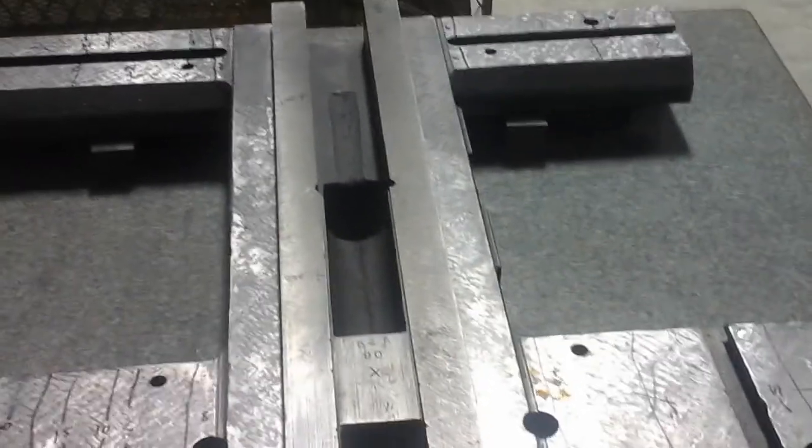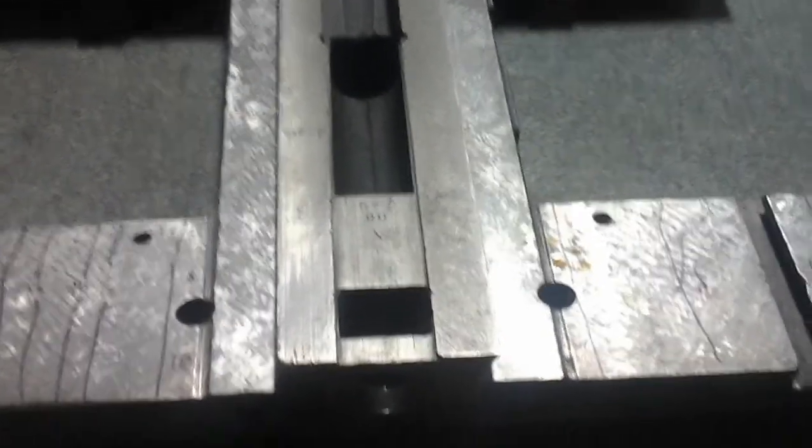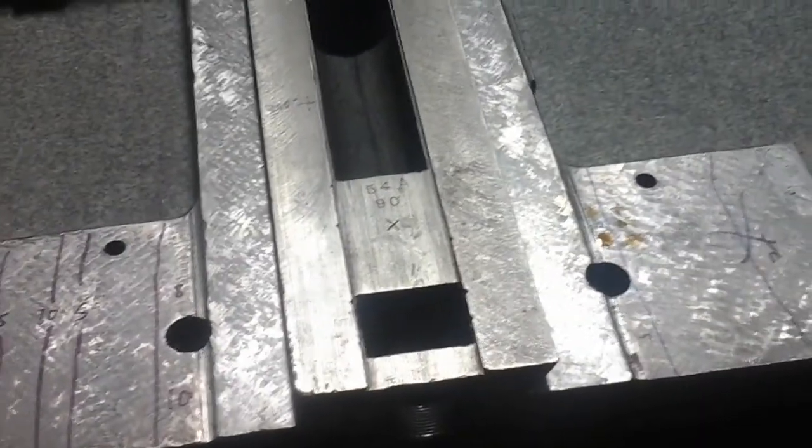It was just where it was the lowest, because the cross slide had worn down so much that it was really riding more on the top of those top surfaces there. And normally there should be like a gap there. It should be riding on these surfaces here and here. And there's also a cover plate that slides across here with the cross slide to cover up this exposed area, and that survived. It just had a surface grind either side of it, and it's going to be fine to go back in place.